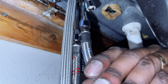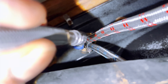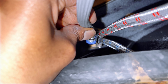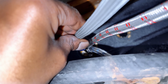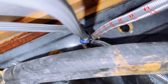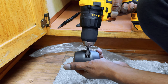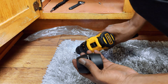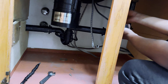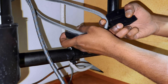Then connect the blue one to the cold water. Once you have the RO system, connect the output to the green one. Right now the pipe hanging from the tap connects back to this blue one — just insert it and it locks automatically. For the weight, to keep the pipe hanging downward, attach this piece: remove the screws, attach it to the pipe, and screw it back.